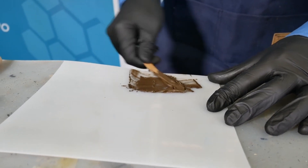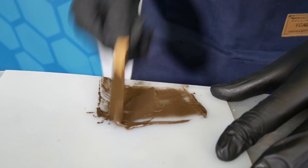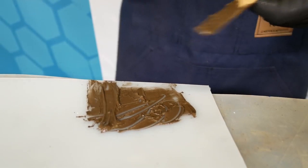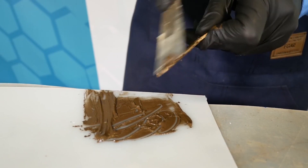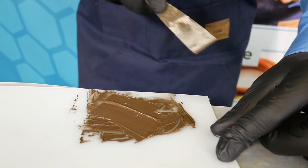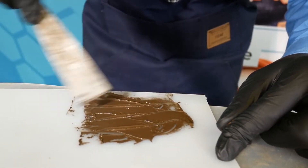As you may observe, while stirring and spreading the glue, I squeeze the air out of it. With a small amount of glue you may use a smaller stick to apply it, or a spatula. Make sure that the color is homogeneous — spread the glue a bit to check this. A uniform color indicates the two components are properly mixed.